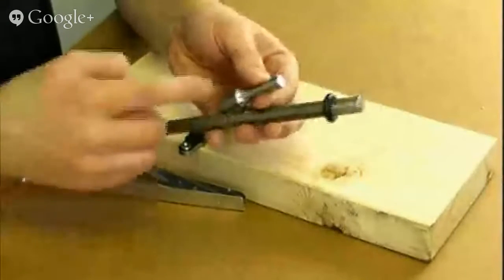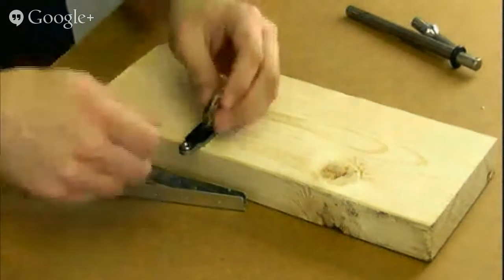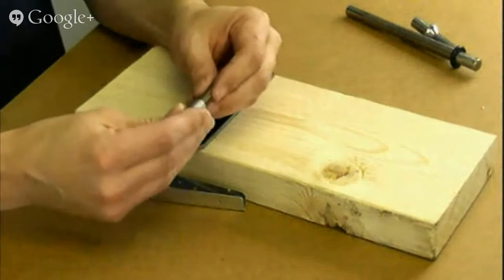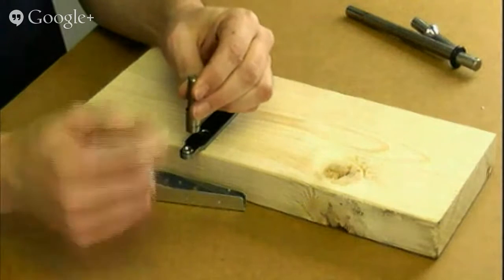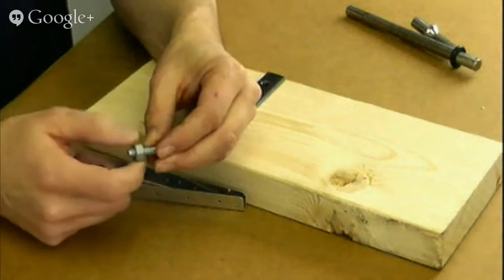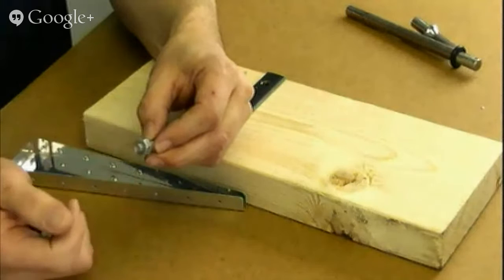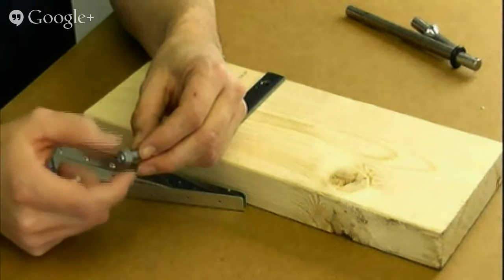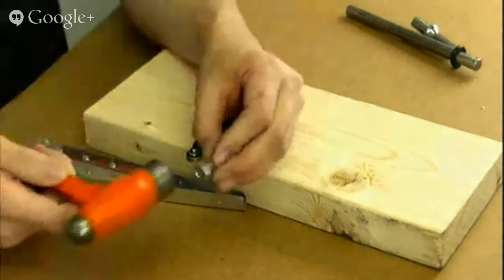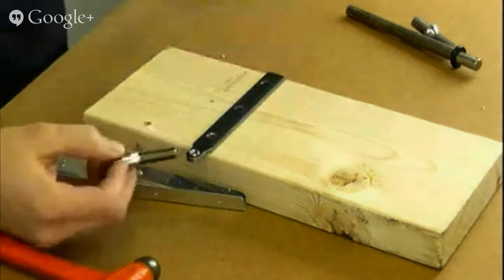If you don't have the C-frame, you can use a DRDT — that's the other way of dimpling rather than the impact tool. You can thread the bottom adjustable piece out and put your male die in there to strike it. The DRDT has a jam nut so you can adjust the set holder. Leave the jam nut on to protect the threads when you hit it with the hammer.